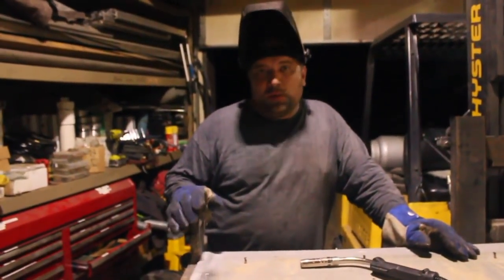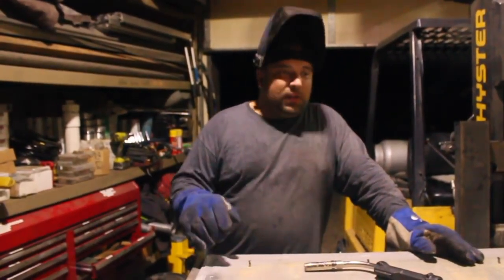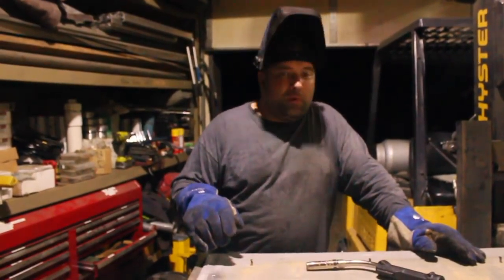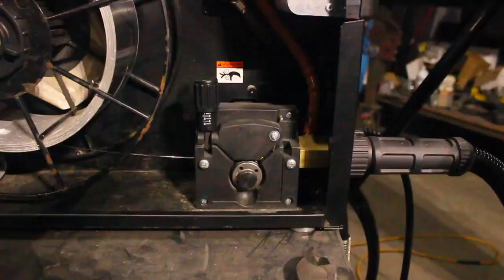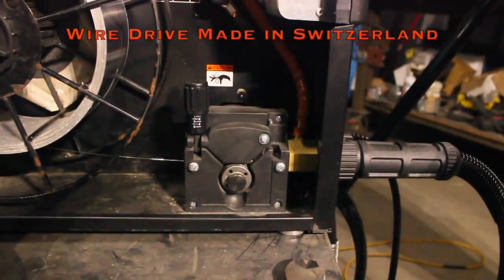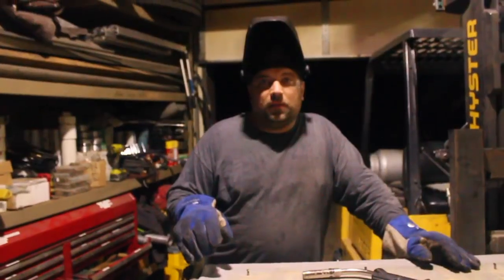And normally when you weld aluminum, as you all know, even welding with a spool gun, typically if you do like two and a half hours worth of welding, you have like 25 tips in your pocket and every few minutes you switch one. So here we ran about 4 pounds of wire through and didn't have to change tips once. Yeah, it was pretty good.